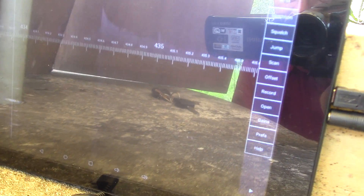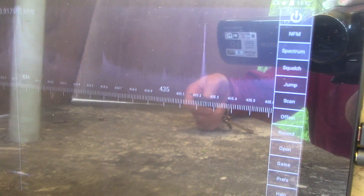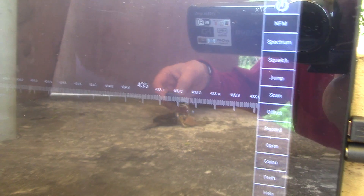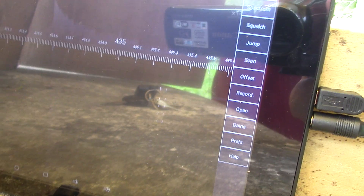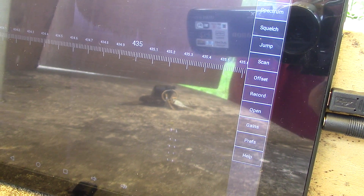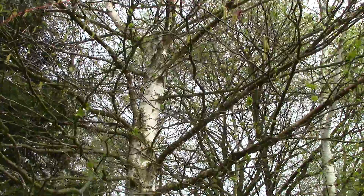Here we are up at 430 MHz and the ISM band. If we press the car key, you can see the spectrum peaking — and there's another car here. This is a great tool for looking at 1 MHz of spectrum. The SDR Play RSP can do 8 MHz on more powerful hosts, but just using SDR Touch you get a 1 MHz window.